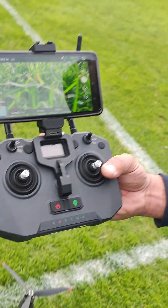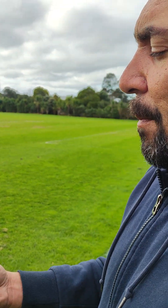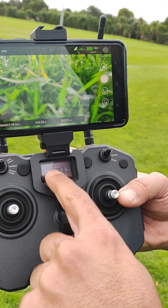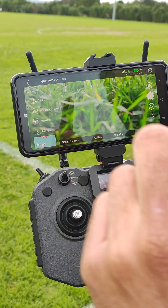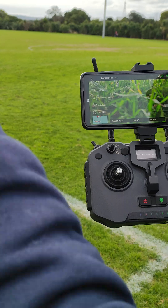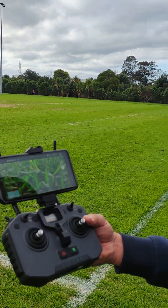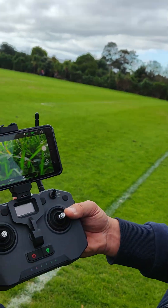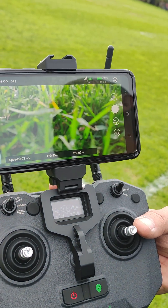One very important thing you need to check before you fly — particularly on your small screen or the mobile phone screen — is that you are in GPS mode. If you are in ATT mode, the drone will start up and you'll be able to take off as normal, but the moment you let go of the joysticks the drone will start drifting. I may show you the drone's behavior in ATT mode during our short flight, but most importantly, to have a successful flight, make sure you're in GPS mode before you take off.